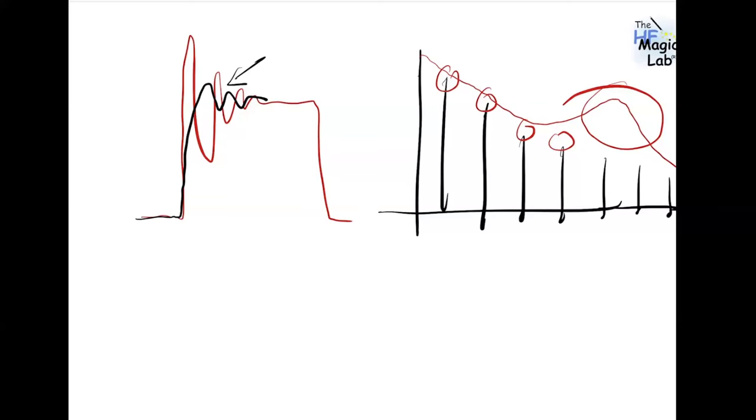So for debugging, my recommendation is to use the peak detection. If you pass in peak, you will pass in quasi-peak. That is the idea, and the peak detection is additionally faster. You have a lot of books, application notes, and references where you can learn the schematics and the waveforms that you can obtain from these three different detectors.